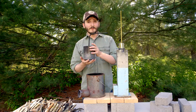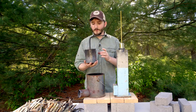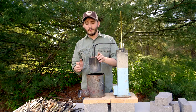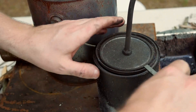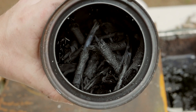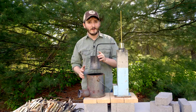The issue I've had with this design is that for pure wood gas production, there's a big delay between batches. Once the biomatter inside the small can has been carbonized, you have to wait for it to cool off to open the can, empty out the charcoal, and then refill it again — and by then the fire in the stove below has probably gone out.